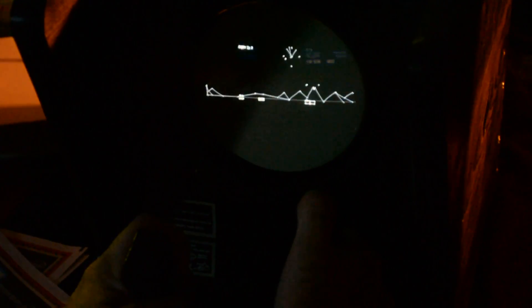What we've got right here is a 5-inch TV test CRT with a deflection yoke on it that I wound myself. We've got a Cortex-M4 microprocessor running an emulation of the game, and that runs the DACs that generate the deflection and put the display up on the CRT.